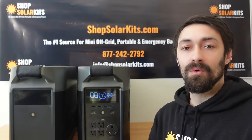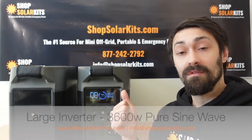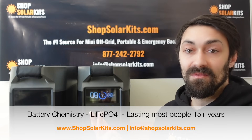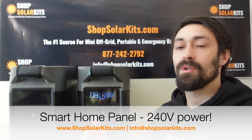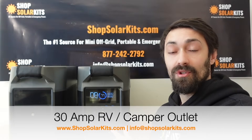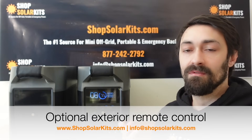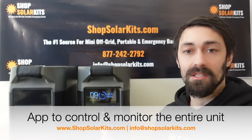For the pros, I feel like I've spent most of the video talking about what's awesome about this unit, but I'll list them out quickly. It's got a very large 3,600 watt inverter and a large battery. The batteries are lithium iron phosphate so they can cycle for a long time — for most people it's going to last 15 to 20 years. It's expandable, you can connect two Delta Pros and get 240 volt output, you can quick charge it through an electric vehicle charging station, there's a dedicated 30 amp service on the front, the outlets are 20 amps not 15 amps, you can get 30 amps out of the DC side, and there's a remote control for van life and RVs. They've even got an app to control and monitor everything going on in your unit.